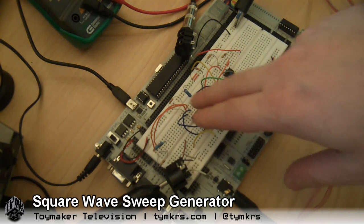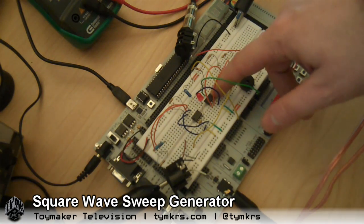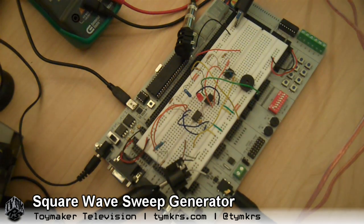It's running through an LED to the clock pin on this digital potentiometer. We've talked about the digi-pot before — it's pretty simple. It has a chip select pin; the chip will only change its resistance if that chip select is on ground. In this case it's just permanently tied to ground, and when it receives a clock high it checks its UD pin — up or down — and if it's high, the resistance changes towards one side.